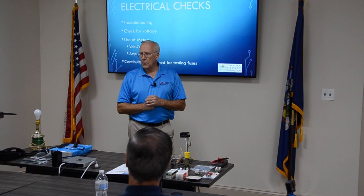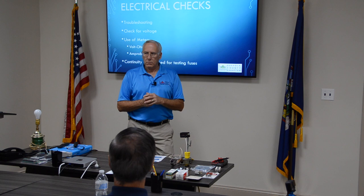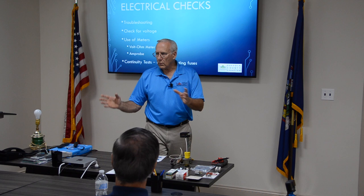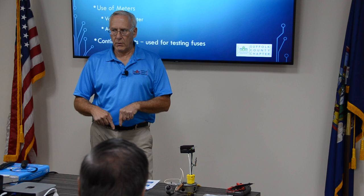The earth, the big ball, can accept every ounce of electrical power produced on it. It can absorb it all. Lightning, power plants, anything. And if it has to go through you to get there, it will. And it will kill you in the process. Okay? Let's go over that again. When you are going to touch an electrical circuit, whether it be these wires or a contactor or anything that you want to make sure is not energized, you are going to reference it to the earth because that's what you're standing on. Very important concept.